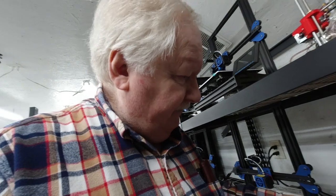That was before I came up with the filament counter. Now once I got the filament counter, I started taking those spools of orange PLA that had already been opened and spooling off portions of the remaining filament on those spools for different print jobs down here, which is what I was doing on this one. But as you can see, once it was left on the printer here for, let's see, about a month, maybe a little bit over a month. It's been on here since almost Thanksgiving, if I remember correctly. So in that period of time, the remaining filament on this spool has completely degraded and become as brittle as raw spaghetti.